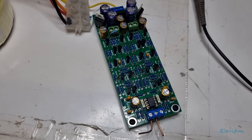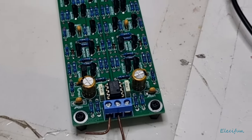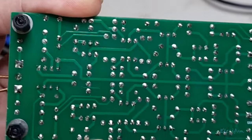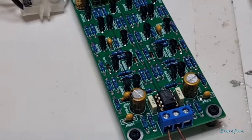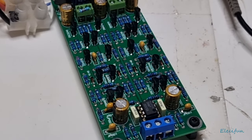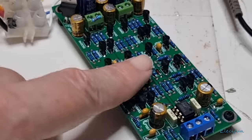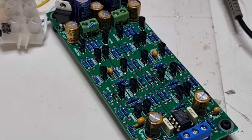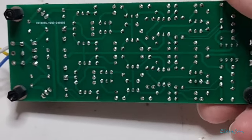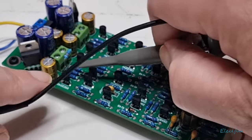I've got this built up now — looks nice enough, quite a nice little layout. The underside is cleaned off and done. The only thing I had to do was put in one of those transistors wrong, take it out and top it up — can be a bit of a pain. So what I'm going to do now is I've done an intermodulation and distortion test, and I'll quickly reset this up to show you the other side and get on with the rest of the measurements.